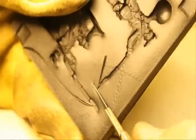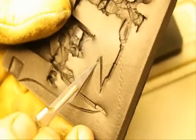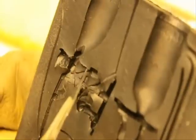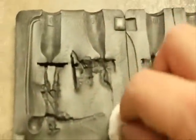The purpose of vents is to allow air pockets to be pushed out of difficult spots. The metal will not flow more than a centimeter in vents before it cools and sets solid. There are still some possible venting points, but overdoing it can weaken the pressure pushing the metal into the mold, defeating the benefits of the vents. Test it first before venting excessively. Remember to warm the mold again before casting.